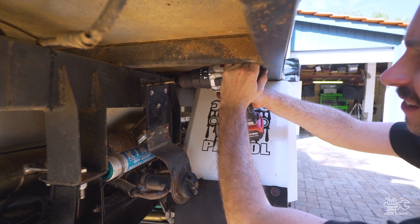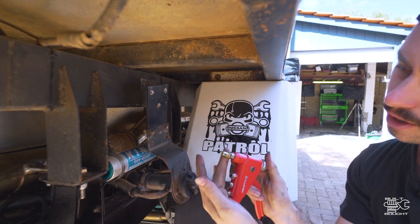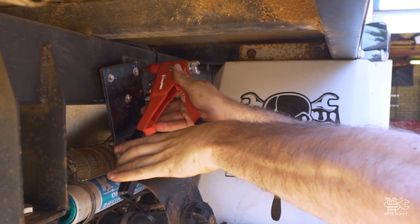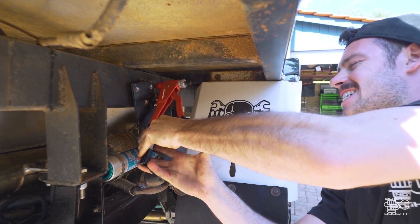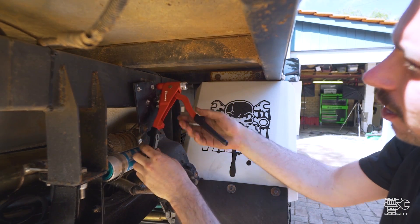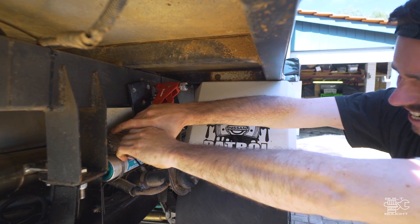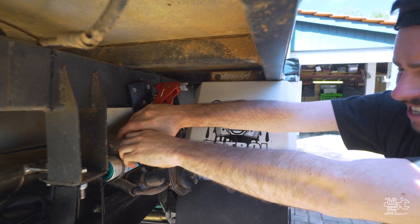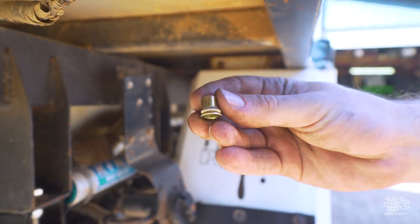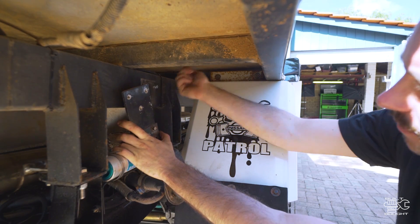We'll drill these 9mm holes — the holes are already there so we're ready to go. You just screw the Nutsert fitting onto the end of the tool, bring it up, and squeeze — this takes a bit of muscle, which I don't have, but we'll see how we go. What it's doing is squeezing the back end of the Nutsert to lock it in place. I've got one Nutsert in there, I'll go do the other two, then screw that bolt in and there you go.